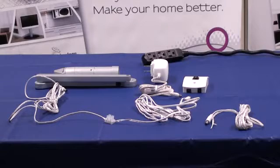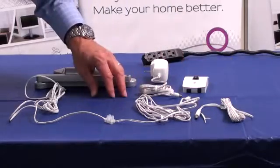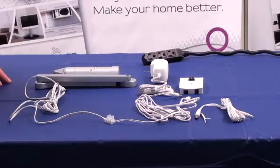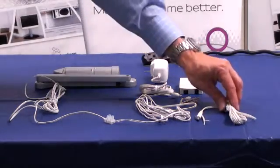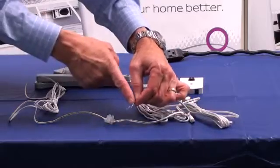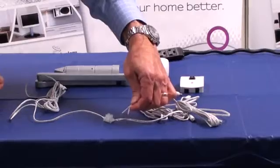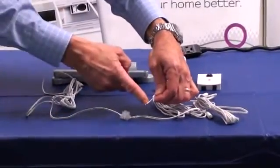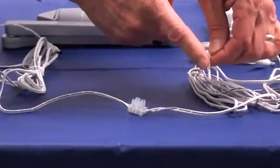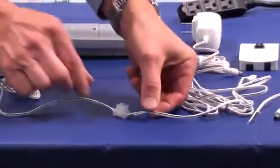Find the wire from the opener and the wire from the operating source — in this case, the manual switch. There will be two wires total. Each wire has two leads. Separate them as shown. Next, strip one-eighth to a quarter inch of plastic insulation from around each lead.